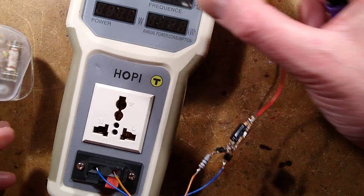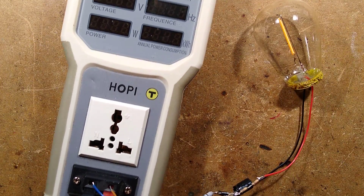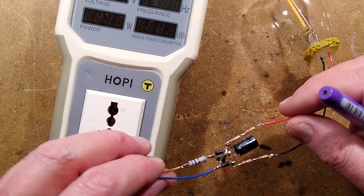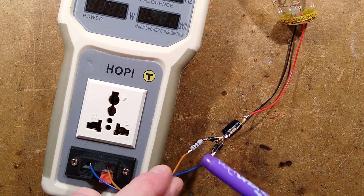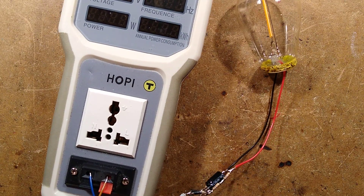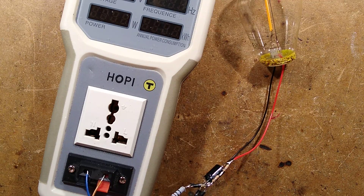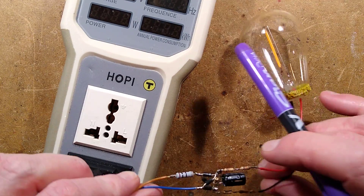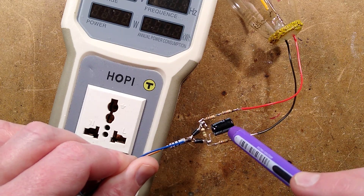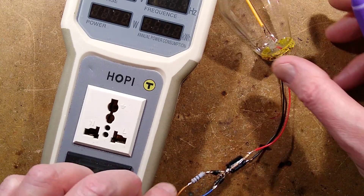Here's my dangerous cobbled-together setup. Here's the lamp, which I've put some wires into and filled with resin to protect from twisting. The power supply is made from discrete components soldered together, all bare and live - not great, but fine for prototyping. There's the 10 ohm resistor, the bridge rectifier cobbled from 1N4007 diodes, the 1 megohm discharge and load resistor, the capacitor, and then the four resistors in series with the lamp.